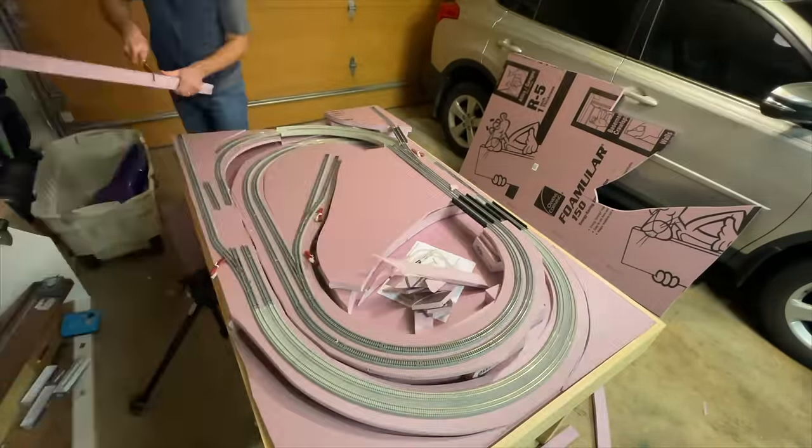The effect is similar and it works regardless of train length or speed, though you can still run a long train around the layout fast enough to prevent a signal from ever turning to green, since the layout just isn't that big. Just using the time delay makes the wiring a lot easier though, since all you have to do is connect each of them to power. I installed a couple sets of terminal strips under the layout to connect all the signals to, and then I have those terminal strips in turn connected to one of the toggle switches on the front of the layout so they can be turned on or off.